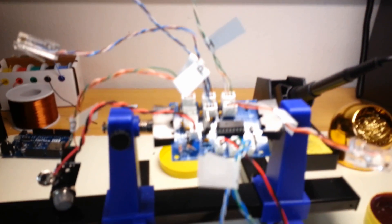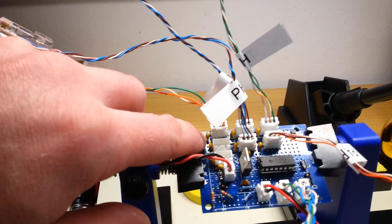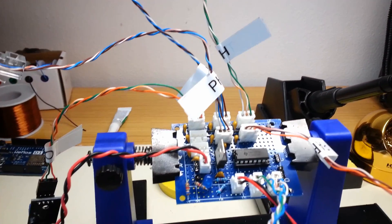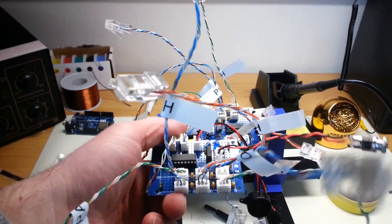Second reason why is I got the Mark II board fully connected, all the sensors tested, everything worked very, very nicely, and I've built the second Mark II board, so let me show you that. There's the second Mark II board. Turned out really nice, and I've also added, at the recommendation of some different followers, capacitors right here to each of the analog sensors to help with electromagnetic interference from the wires and such. So now we've got one and we've got two — two of them.